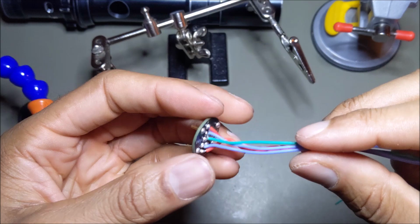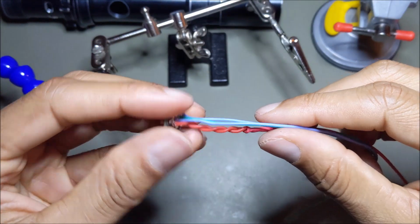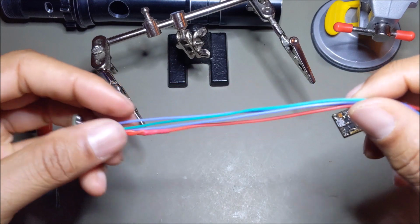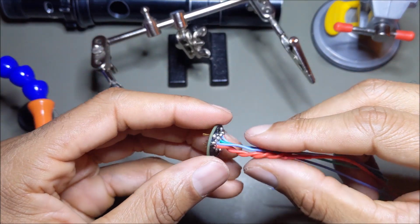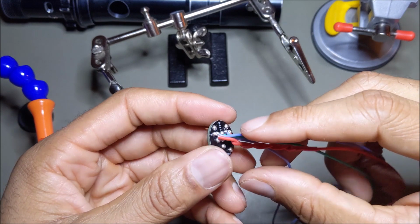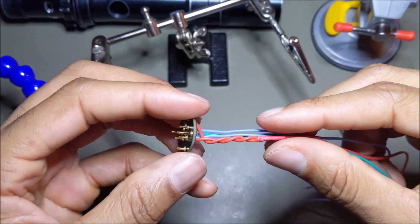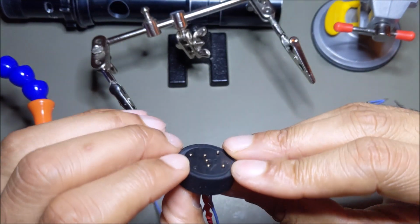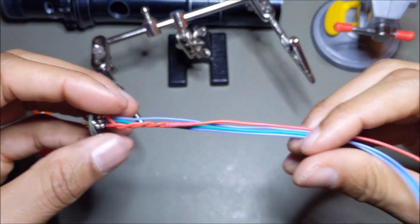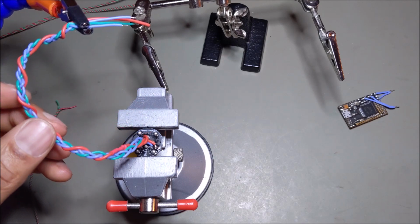Okay, everything is soldered to the neopixel connector, and the two power wires are going into one. I think I will most likely braid all these together, so that way it feeds neatly into the board, and I can easily coil it once I seal it up. And then I'll seal the back of this with some hot glue as well. But I'm going to wait until I test everything and make sure that everything works and is a go before I do that and coat it with some hot glue. But for the most part, the neopixel connector is just about done there. Okay, I'm going to braid this and feed it down and get ready to connect to the board. So everything is braided and that'll coil up nice, good to go. Let's move on to the switch.